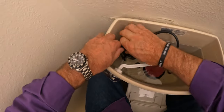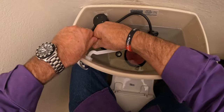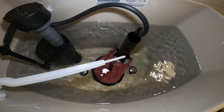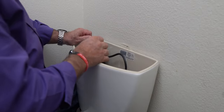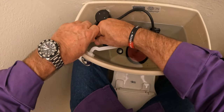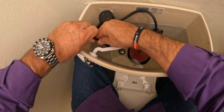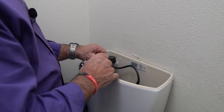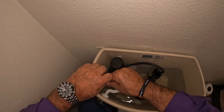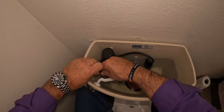I'm going to reach down in here and pull it out from this assembly. This is the assembly that, when it comes down, turns the water on, and when it comes up, turns it off. This is a threaded piece down at the bottom. I want to screw it down about an inch so it comes up to about half an inch from the overflow. I'm going to just turn this — as you see, it's scored on the top so you can use a screwdriver. You may need a screwdriver, but chances are you won't — these are plastic pieces. If you've got an old brass one, you may need a screwdriver. I'm going to screw this down about an inch, and now I'm going to slide it right back over and clip it back together. That was really very easy to do.